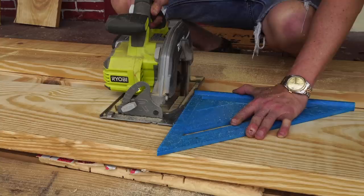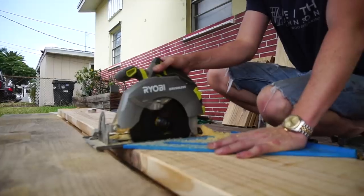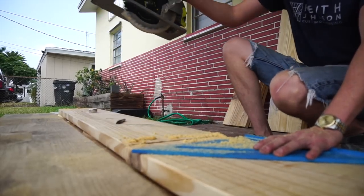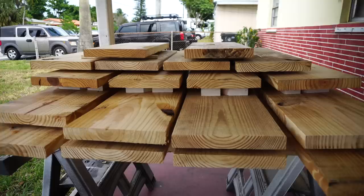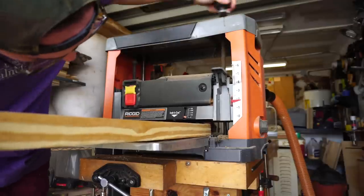I'm using 16-foot boards because those tend to be the clearest and the driest of the bunch, and then I break them down into manageable yet oversized chunks pursuant to the cut list in the book. Since these are construction-grade boards, I stickered and stacked them to let them get to equilibrium before running them through the thickness planer, to get them just a hair above the final thickness.